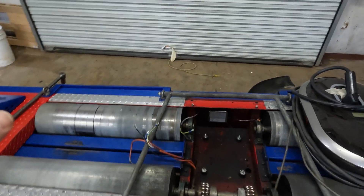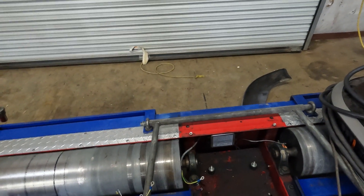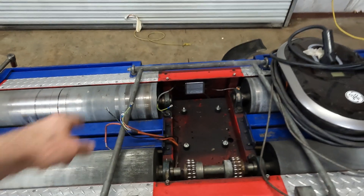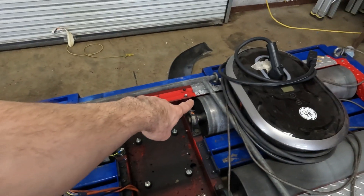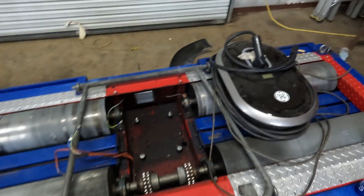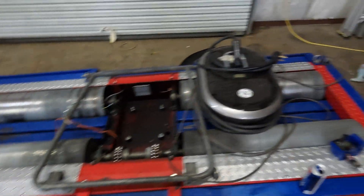I got to rewire the mains voltage after it goes through the filter. I got the power to the brake here. I got brake over temp and then just some other stuff back here. The main input over here is the strain gauge or the load cell, which is going to go to the new controller. Just going through getting everything set up and planned out.